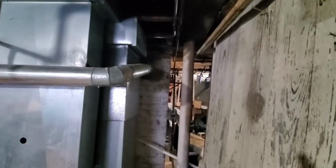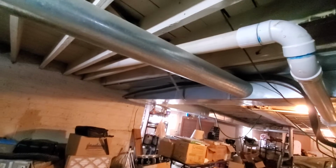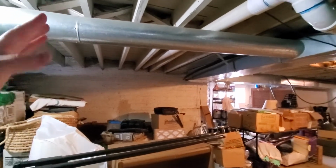The homeowner is insistent on high efficiency because the masonry chimney is in very poor condition. They already had the 90% tankless hot water heater installed. They want to do something similar. However, they don't want to go to that side of the house with the venting because they're thinking of possibly putting an addition over there. Thus, we're going to do the venting over here.